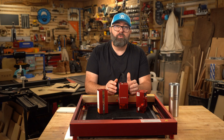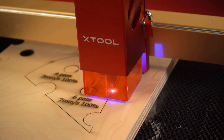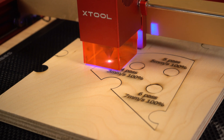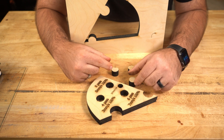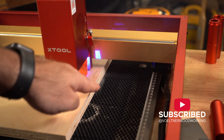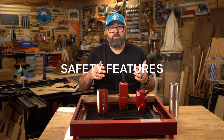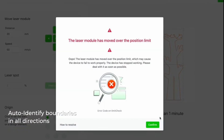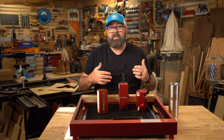There are a lot of videos on the Xtool 40 watt module on YouTube where people are apparently trying to set their machines on fire cutting two-by-fours and other thick wood. I thought I'd give it a shot on this three quarter inch UV coated birch plywood, and it was really impressive. I was not only able to cut through this material in as little as three passes — honestly it cut most of the way through in the first pass. You can tell it's cutting all the way through when you start to see smoke coming out from the bottom or sides. Although you should never leave your laser unattended while running it, the Xtool has safety features built in like the tilt sensor and flame detection.